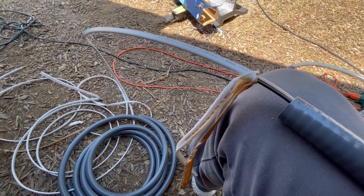Thanks everybody. So we're doing more wiring. These are all the 110 circuits of the bus. We've got outlets, TV. The yellow and the orange are both 20 amps, so these are 12-2, and then we have outlets in the back room. All of this comes into this nice little work area, which might be a little hard for you to see. Now it's pretty tight.